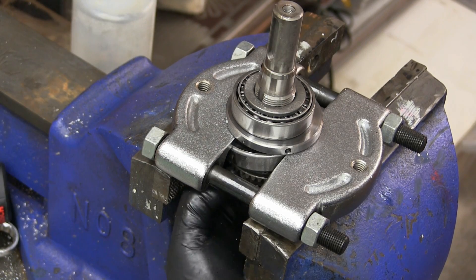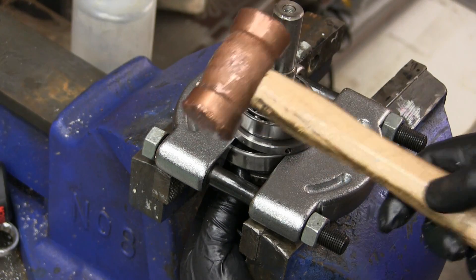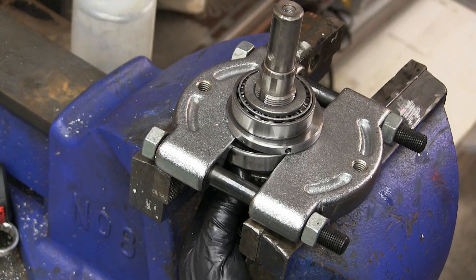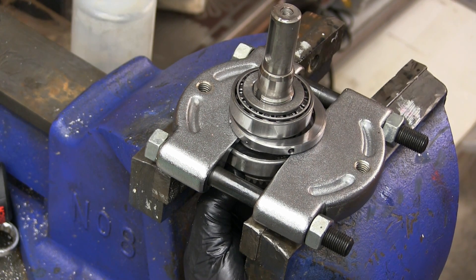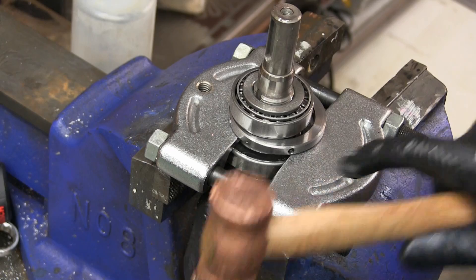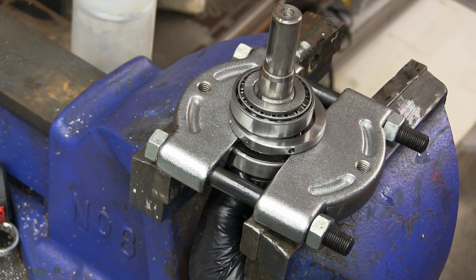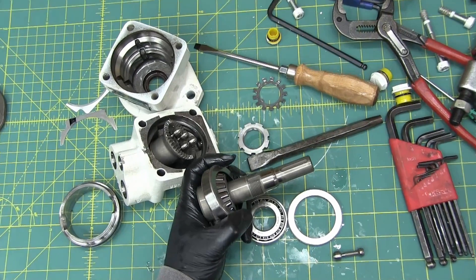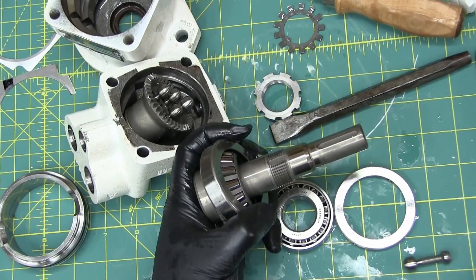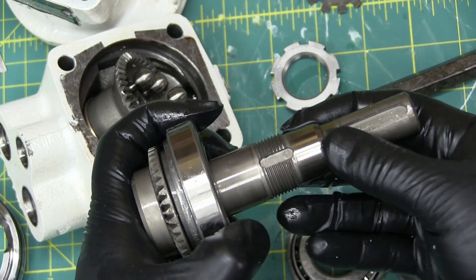In the vise featuring a very useful tool — the bearing splitter — and we channel our inner millwright. Got the Lerner hammer here — copper, non-marring — and we'll just give her a little tap-y-tap-tap. And out she comes. I would have thought this spacer ring would have been threaded into something, but it's just strictly a spacer. And there we go — that's it. Feast your eyes on the beauty of taking apart industrial stuff — we get to see some amazing attention to detail in this piece.